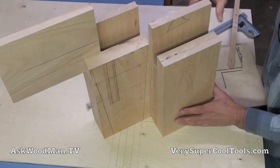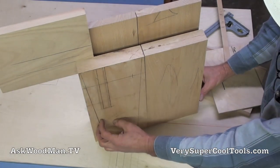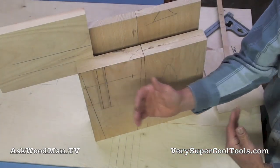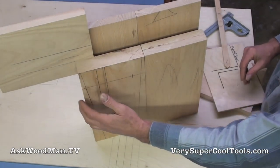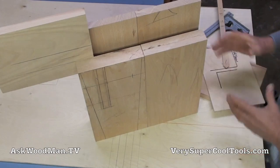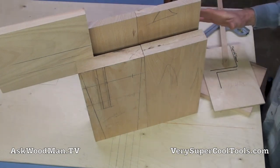Here's the other thing I have to start taking into account right now: there are going to be two mirror images of one another because of the way this design works. I'm going to have two in this relationship and two with the slot over here, so I have to draw it out and make sure I really understand it — I always have either an A-end and a B-end or a one and two. I'll mark them pretty soon. If these two were both going to be A-ends, the slot would be here and this slot would be here. It's only two ends but they're mirror images, so you just have to take that into account.